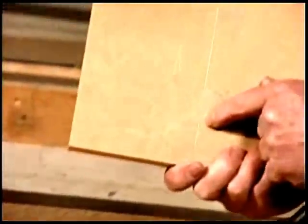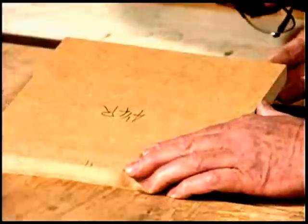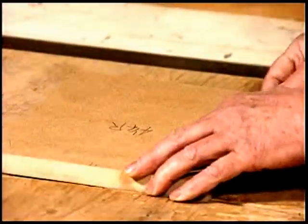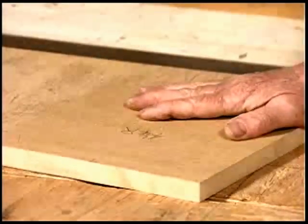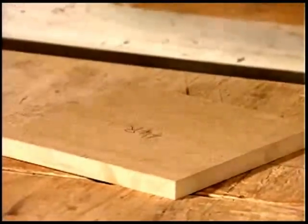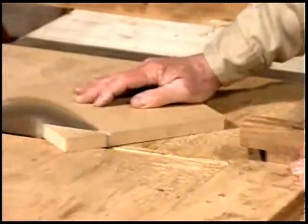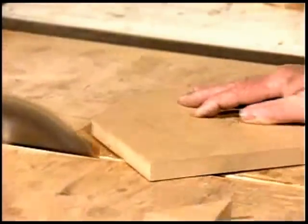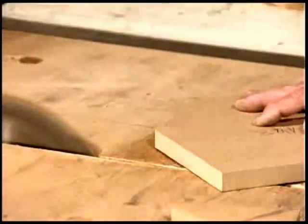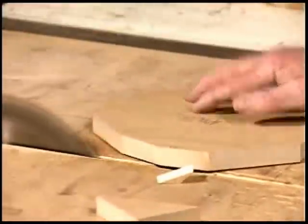Now, it's important when you put your board on the saw that you put it on the center of the board, so I'm going to have it just slightly overhanging the kerf in the sliding table, and I want to put it right down on that pivot point right in the middle and nail it down. Now, I want to cut this into an octagon. You've got to hold it down to the table to keep it from spinning. So you just cut the corners off, and then you cut the corners off again, so you're actually making sort of a 16-sided figure.